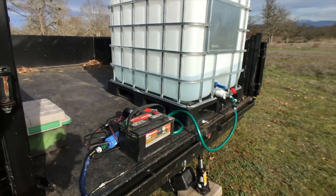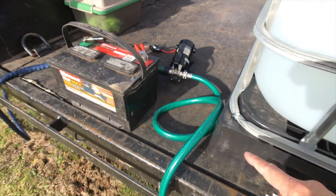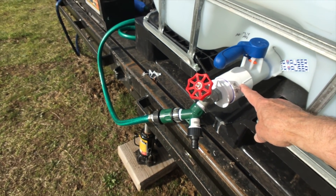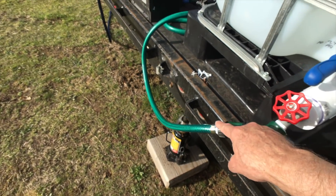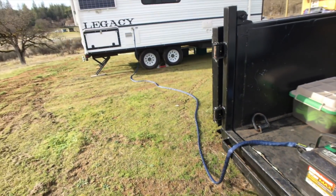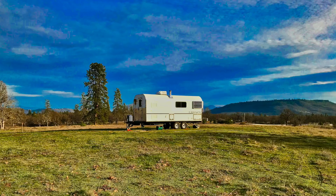Since we don't have the well right now, this hose is going straight to the IBC tank, with a hose going to an inexpensive 12-volt water pump running off an extra car battery. The connecting hose goes to a valve setup — when we got the IBC tank I took a two-inch threaded coupling, put a reducer to three-quarter inch, added a three-quarter inch spigot, and a little splitter for an extra outlet. This is the inlet to the water pump, and we're filtering our water with a small water filter. That's our water supply for Camp 216. We spent a week here, filled the IBC tank about three-quarters full, and it cost us 75 cents.